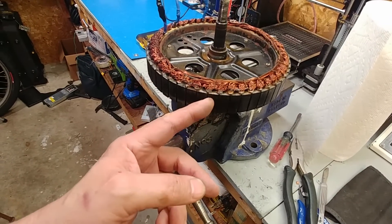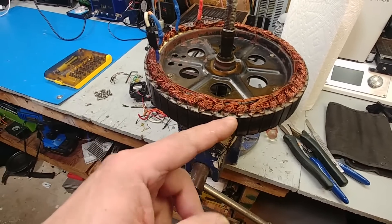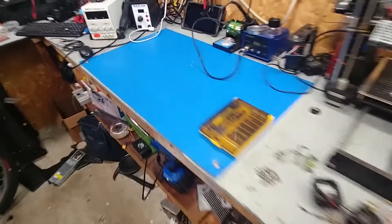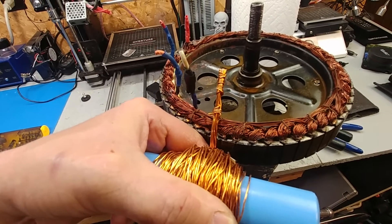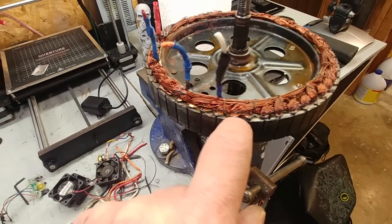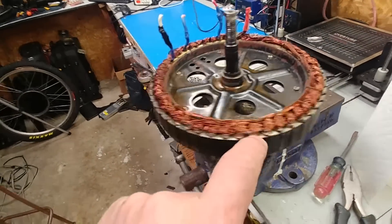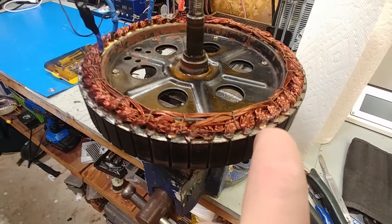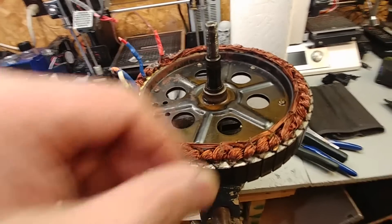In each slot there is a little piece of bamboo - you'll have to find something really fine to get in there and pop them all out all the way around, and then you'll be able to start unwinding the windings and pulling them through the slot. My wire does look considerably thicker than the stuff that's in the motor, but I'll make it fit somehow. You can see this motor has been through hell - that shiny part is where a bit of debris floating around on my wheel cut right into the copper. Some of them look okay, but there's at least one with three or four strands of copper totally cut.